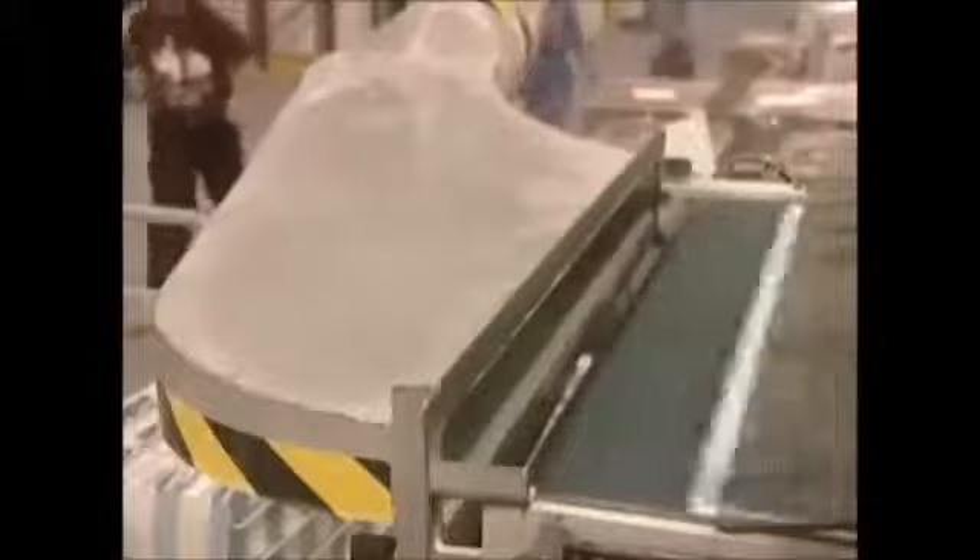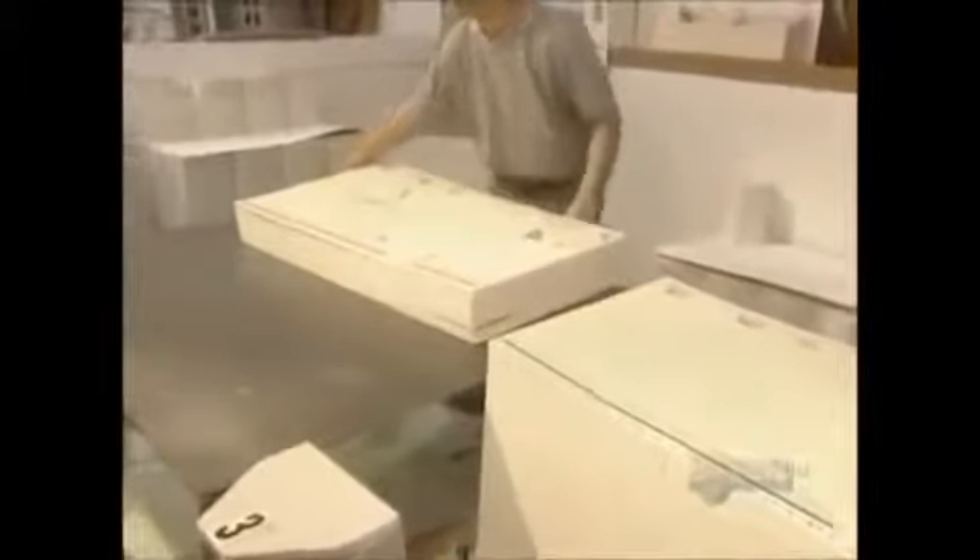Next comes the cutting of the sheets, going on at 8,000 an hour. The cutting unit strips and removes the unnecessary pieces, and the carton scraps are sucked up for eventual recycling. The scraps can also be cut away manually by using a hammer, and the carton end pieces are sent off for recycling.